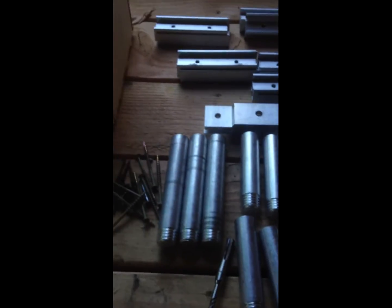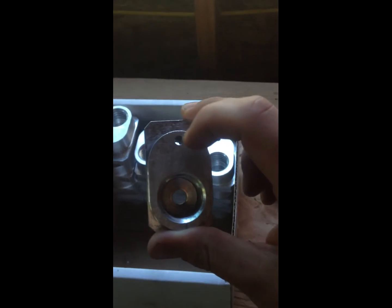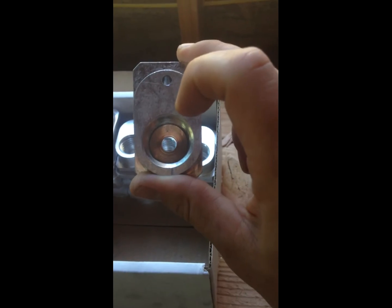And this is a splice kit. Down here we have the actual fast jack roofing mounts. This is the pilot hole at the top where you drill — use it to drill a straight hole. Then position your actual lag over that hole and mount it. Once you mount that, these little poles just screw in and it's flush, good to go. On the top is where you mount your rail system.